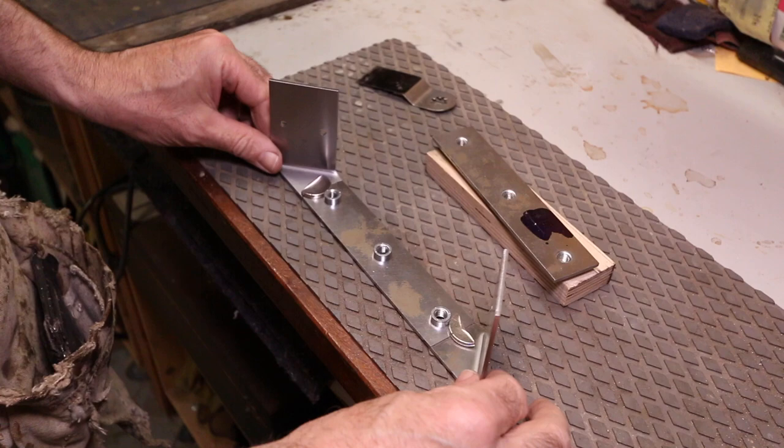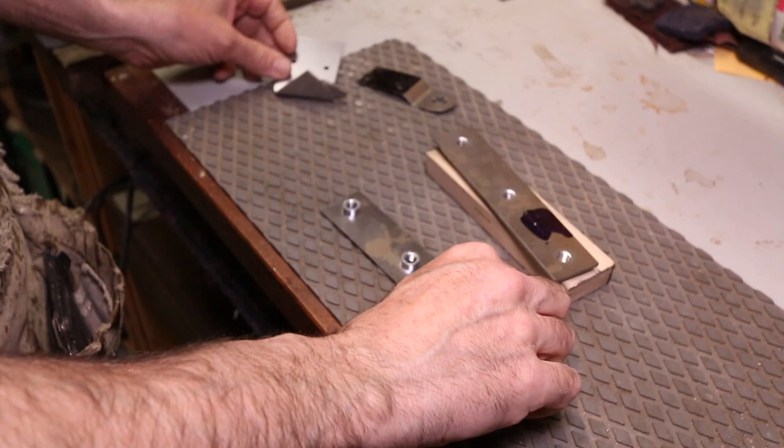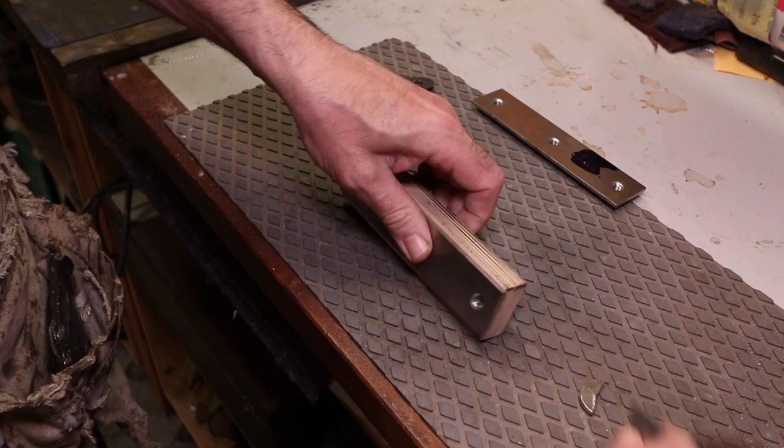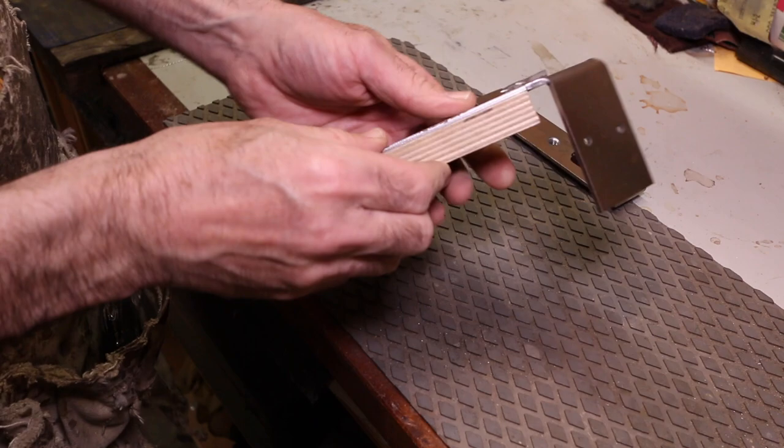So they gave me these brackets right here and needed these wings chopped off of it, like so. So I needed to come up with a way to do that relatively efficiently. And so I made up this little block here. I drilled holes to index these press-in fittings. Put the magnets back on to demonstrate this. And so that left me with this right here.